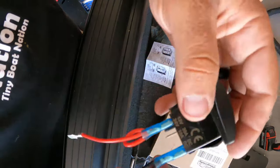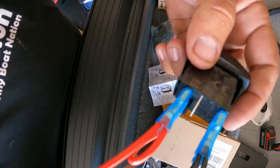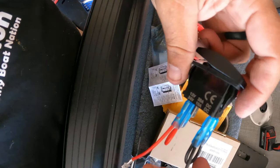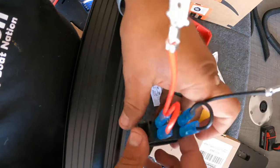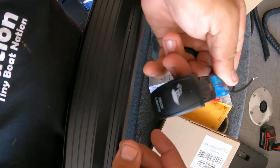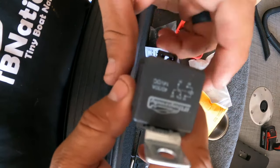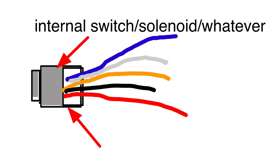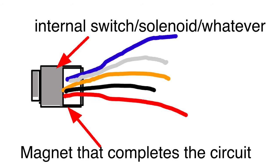If you want those brighter indicator lights, totally rock these switches — just make sure they give you instructions. If you get a different switch it could be backwards, the red could be at the bottom, and you'll melt your whole wiring. These are not universal even though you'd think they'd make a universal five-pin switch lead. Always be careful. So I'm going to give you the Joe Staff version of what a relay is, because if I talk to you like an electrician talks, none of us will ever get it.